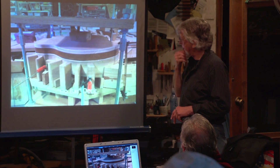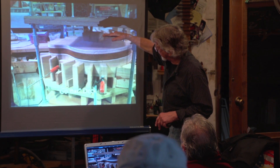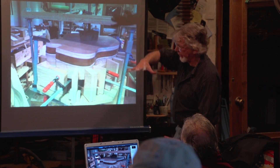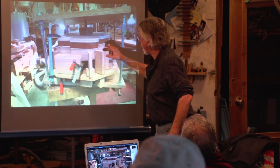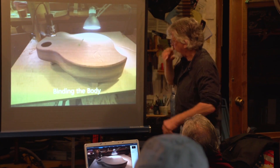You can do this with any plate. This is what's called a go bar deck. We're gluing the top on the instrument now. This is just a big sort of press with a big hand screw up here. We just glue it down — we put a foam rubber piece under one of these cradles, turn it over, and just crank it and push it down onto the thing.